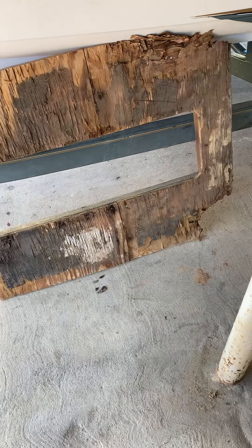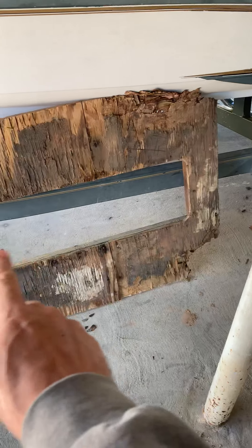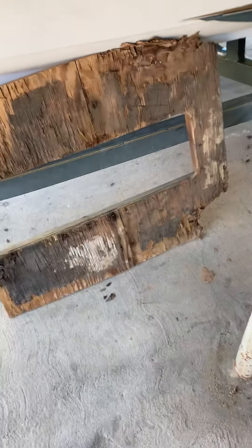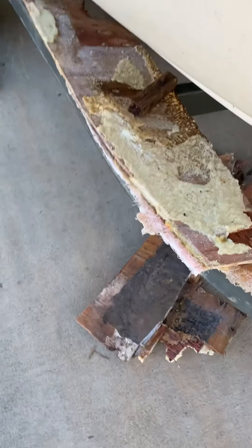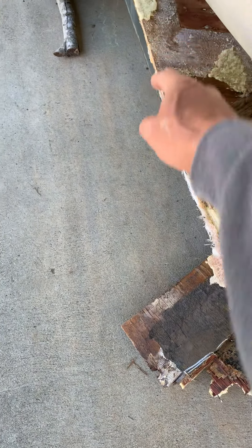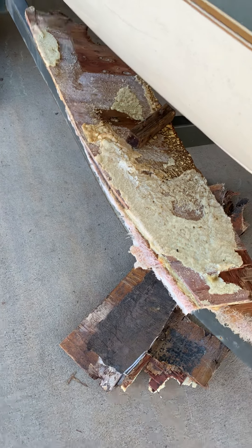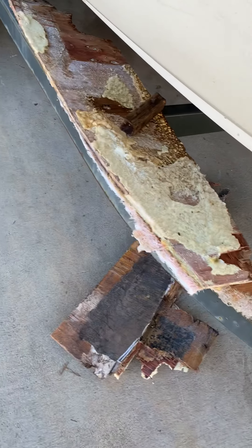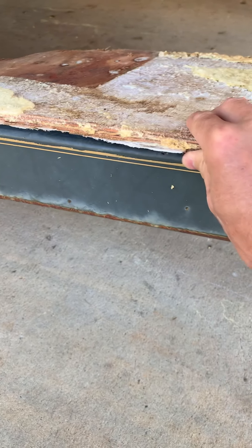This here is the floor cut out — this is where the hatch is. It's not being kept for any particular reason other than so I know the dimensions of that entire square where the ski locker actually sits; eventually that goes in the garbage. Over on this side, you can see this piece right here has this angle — this is the angle of the boat. I kept that specifically for that angle, so when I cut the floors I already know what my angle is across here.